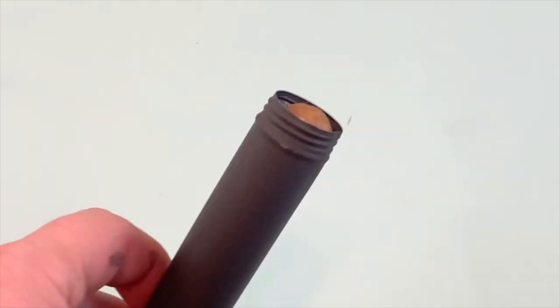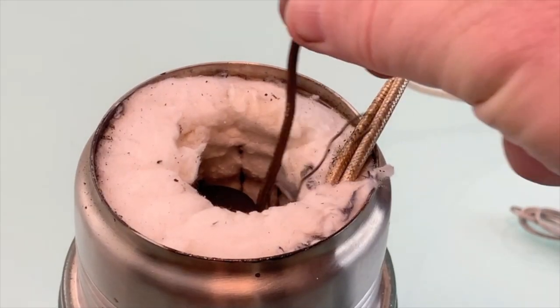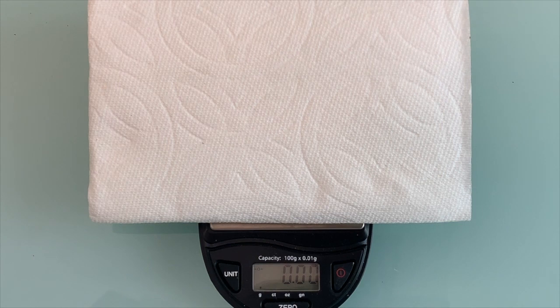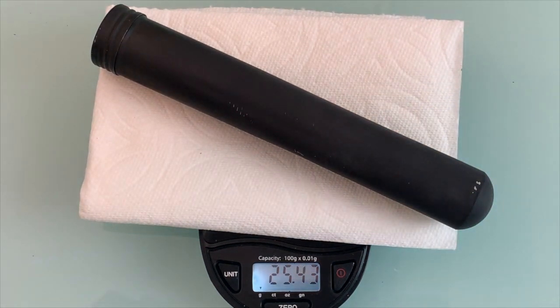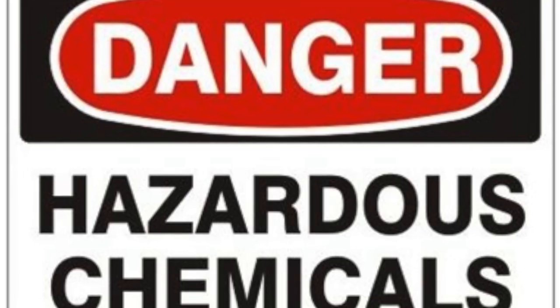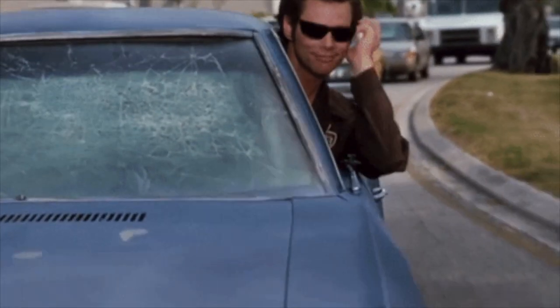First, we're going to drive out the water by raising the temperature to about 120 degrees centigrade and letting it bake out for a couple of hours. Weigh the crucible every 30 minutes or so — when the weight stops falling, you're done. Record the dry weight. If you're using an electronic balance, be careful when making this measurement because if the temperature of the pan changes while you're doing it, it may affect the calibration. Zero the balance with a folded-up paper towel on top to act as an insulator and weigh the hot specimen quickly on that. You need to carry out the next step in an exceptionally well-ventilated place because the stuff you're about to unleash is really nasty. Anoxically cracking these large molecules yields a lot of dangerous chemicals such as methanol, tars, and turpentines that would otherwise be burned up.